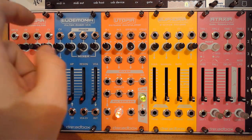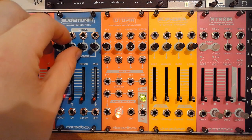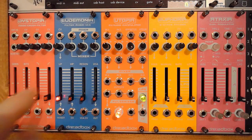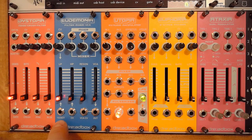These are combined with four inputs — three are the mixer inputs, where you throw in the sounds you want to mix together, each with their own pot right beneath. Those will then be passed into the filters and the VCA. You also have a CV input for the cutoff frequency of the low pass filter, which you can attenuate. There's also a one-volt-per-octave input, and this filter does self-oscillate, so you can use it as a standalone oscillator. The high pass filter doesn't self-oscillate, and you've got CV in for the high pass cutoff, VCA CV in, and a single output.